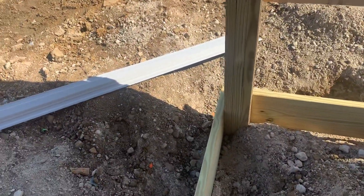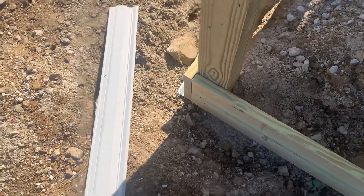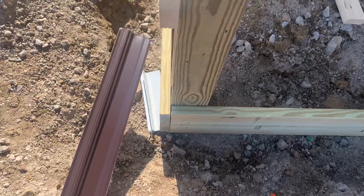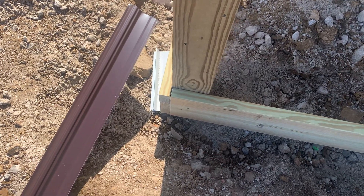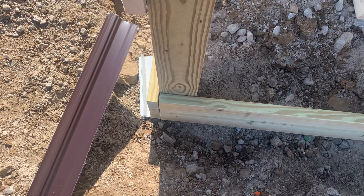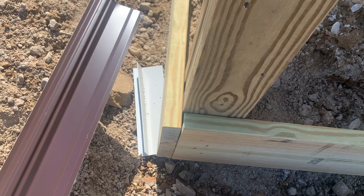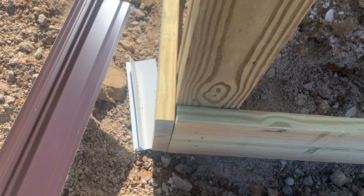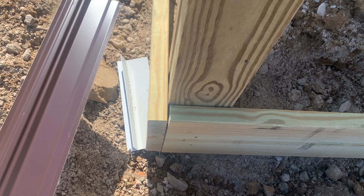Now as far as the post hole depth — in Ohio the frost line depth is 42 inches. So what we have to do is get below that: we dig down 54 inches, and then we put this three-ply laminated column right there on a concrete cookie. Then we put two by six uplifts running east and west, and also north and south, anchoring that in there.